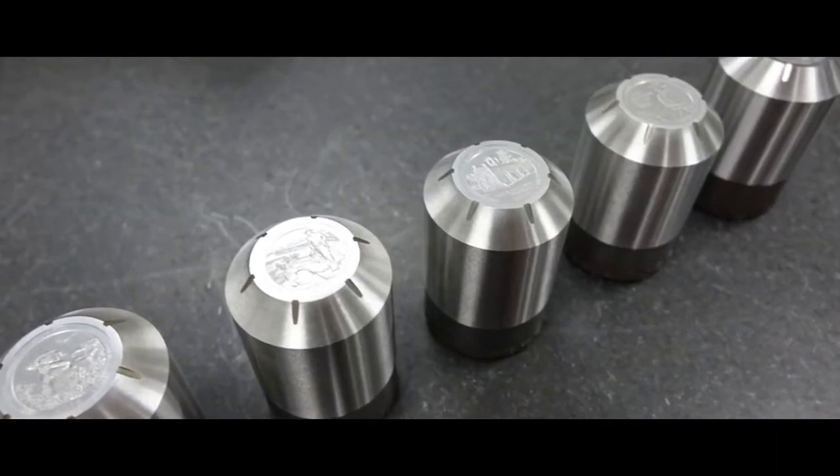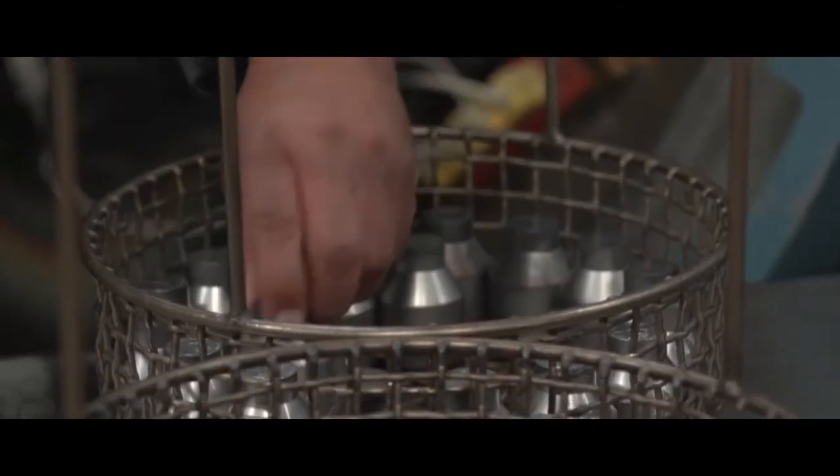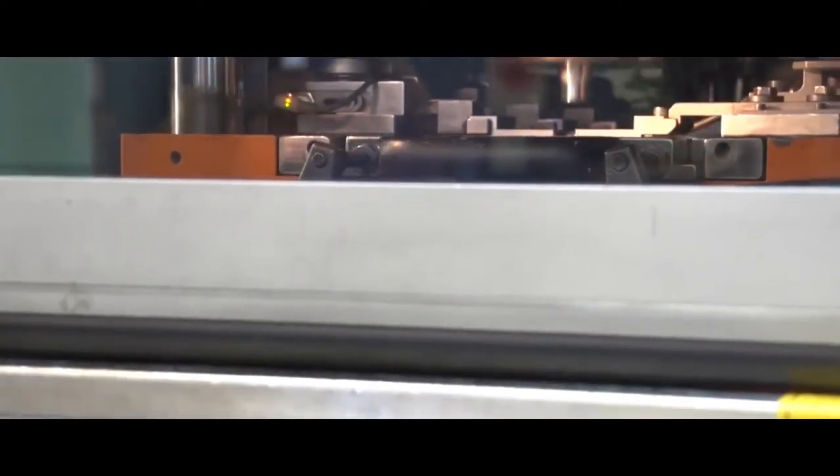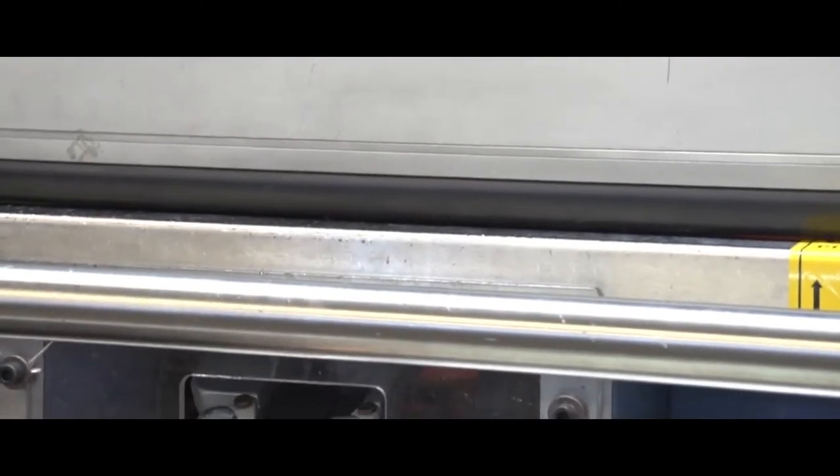In the tachinwerk, the rollers were replaced by rectangular shafts pierced in the middle to take a pair of dies with tapered extensions, or tangs. The axis of the upper shaft could be raised or lowered a short distance to accommodate variations in the dies or differing coin thicknesses. Such machines continued to be used in Germany into the 18th century.